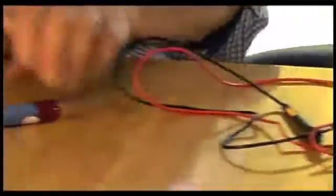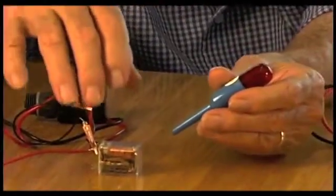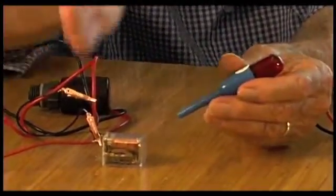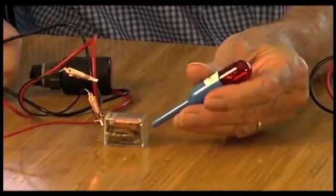It takes a long time to find it on the schematic, then check it and take a reading. Even if you took a reading, you don't know if there's current through the coil. Now if you take a MagProbe, you hold it right up to the relay. Imagine 50 of these together with all the wires behind them — there's a panel right in here, and behind this panel there are all these thousands of wires. Now I want to check this relay and see if it's energized.